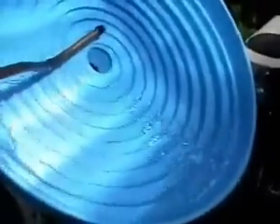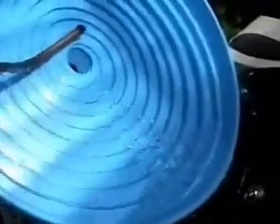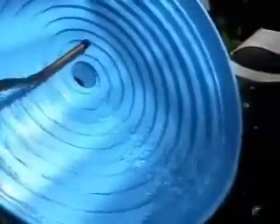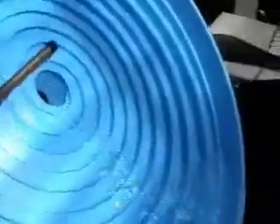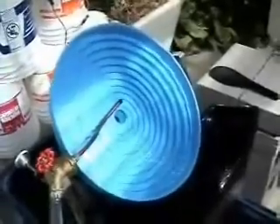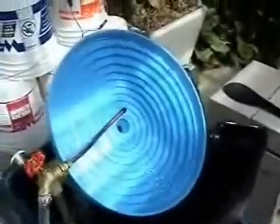Of course all the wheels get the big gold. The wheels with multiple grooves work too quickly — scooping every eighth of a revolution or so — and the gold goes shooting up. That's good for big gold and flakes, but for fine gold it operates too quickly. A friend of mine has one of those and we've done comparisons; this two-groove system on the Gold Genie is far superior for getting the smallest gold.